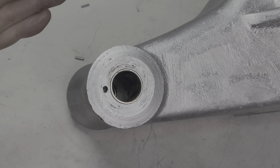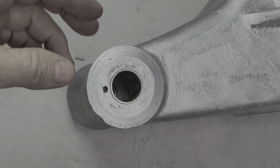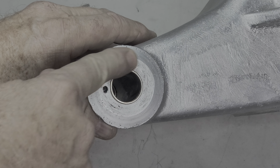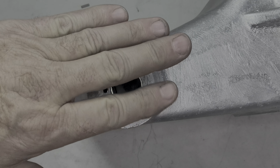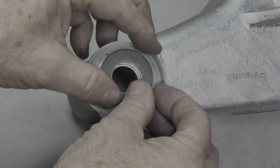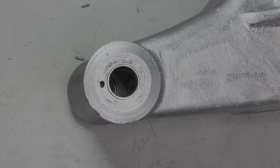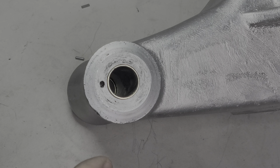This hole is oblong because the dowel had been pushed to the side, so it's obviously not good. You can see this surface here - this thing's been spinning around, and dirt has gotten in and messed up the surface. That part isn't as critical - we just want it flat - but the problem is this is now distorted, which makes it incorrect for proper alignment and stability.